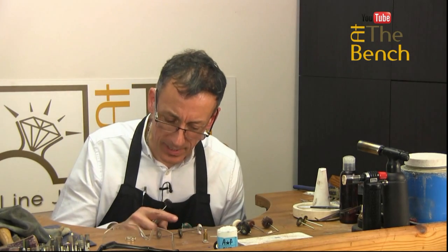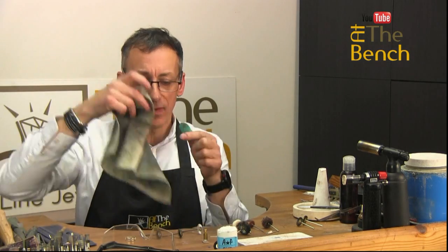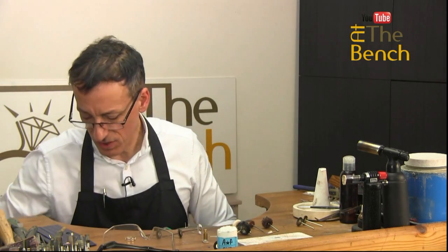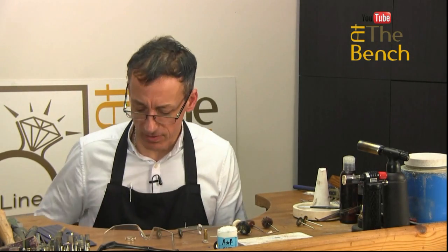Your mop is going to pick up the Tripoli that's on the peg. Not advisable. It's not going to get a lovely high finish, and what you think you're putting on is rouge, but actually it's rouge mixed with Tripoli. Tripoli is slightly rough. You're not going to get a very good finish.